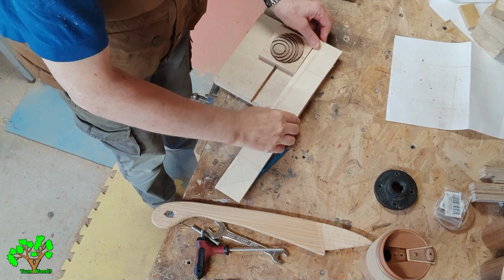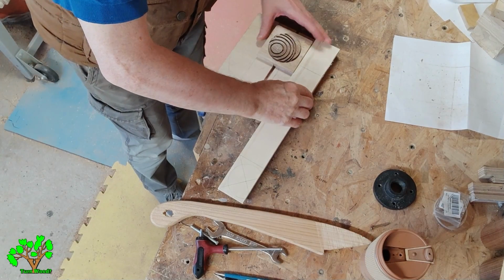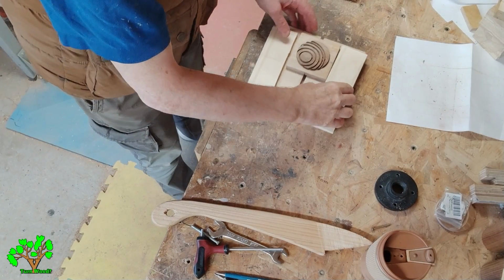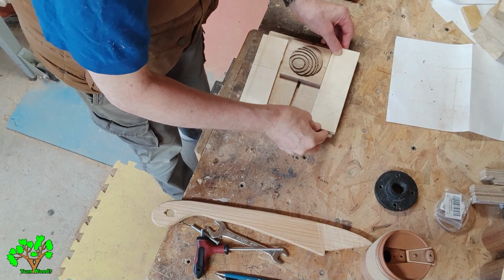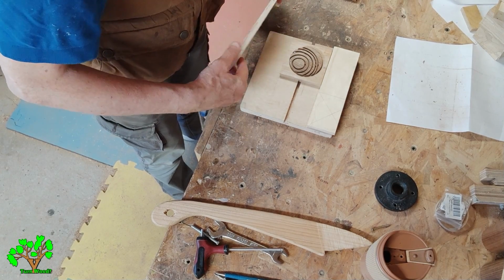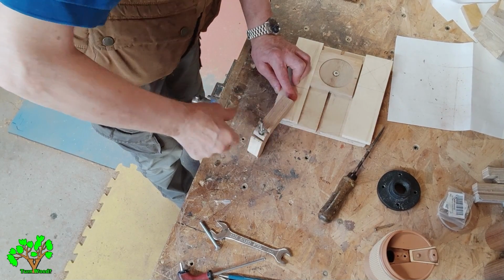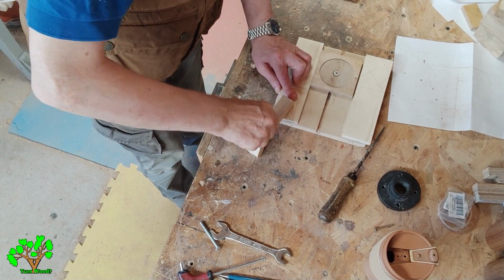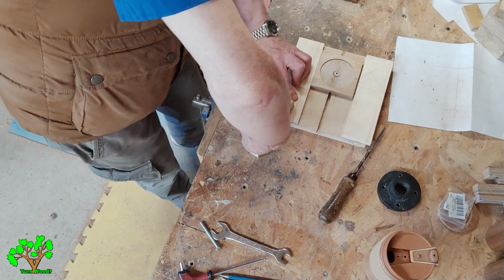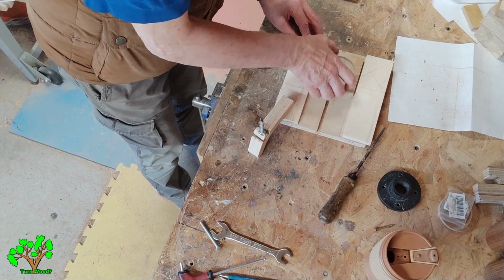I'm adding two additional pieces of plywood at the top and the bottom of the base plate to make a channel for the pendant frame to move along and stop it twisting etc., and I can use it later for marking positions of the frame along the base plate. All the time that I'm making these additions I have to bear in mind that I haven't to produce thicknesses that go beyond the top of the pendant, or at least above the top of the pendant frame.